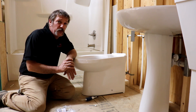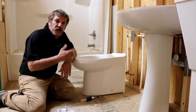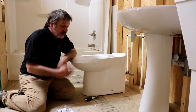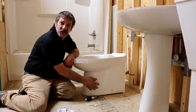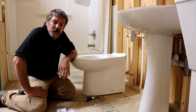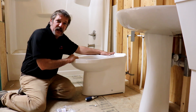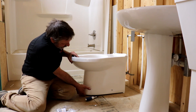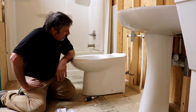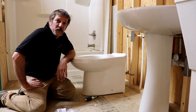This video was kind of a fail. I'm not really pleased with what's going on here with this toilet — I don't think these brackets work worth a poop. There are some other skirted toilets out there with a big hole and a plug, where you need a little special tool to get in to reach your closet bolt. Never really had any problems with those, because those are bolting straight down, where this is bolting through the L bracket. I could cram shims up under here, but it's still going to bounce. I think this is just a bad design. I don't know the solution to this one, so I guess this one was a big fail. But thanks, everybody, for watching.